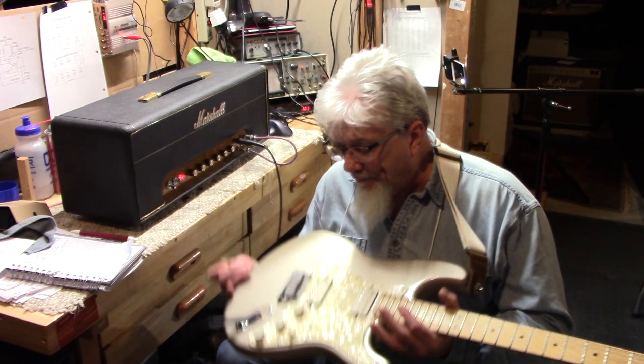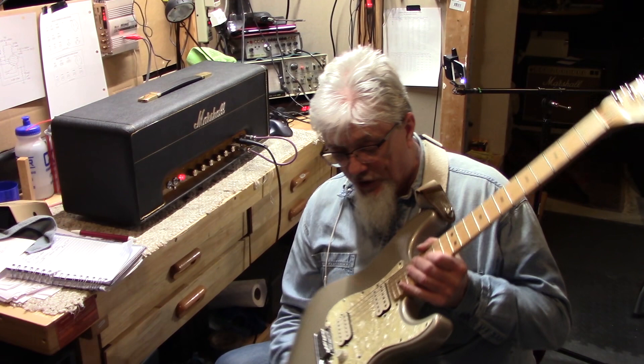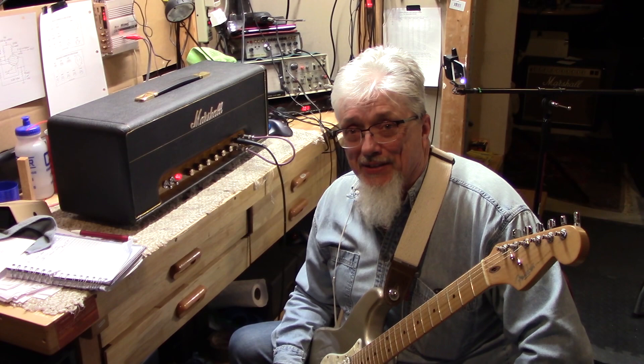Different guitar tonight — this is my Big Apple Strat, a '97 American Strat with a couple of Seymour Duncans, I think a little '59 and a JB. It's a fun guitar to test with because it has relatively hot humbuckers in three of the five positions and single coil in two positions, so you can hear the difference when switching. The amp was modeled after a late '50s Fender Bassman, and that's actually the schematic I was using to work on it because the component values are all the same.